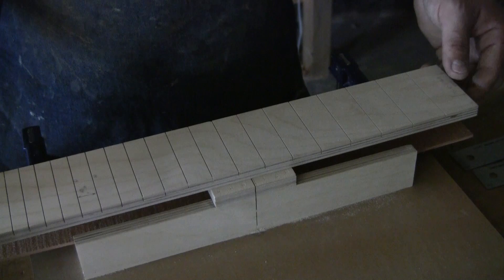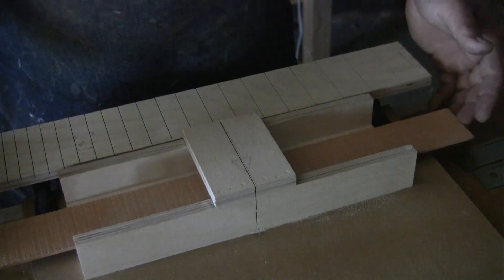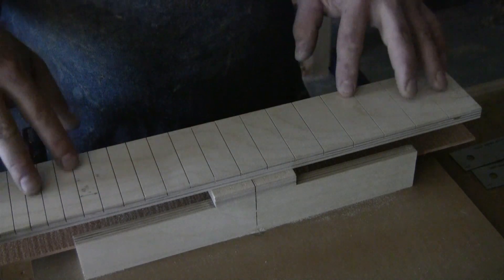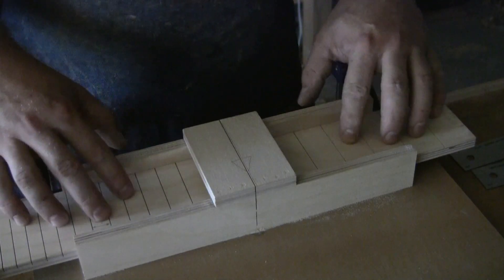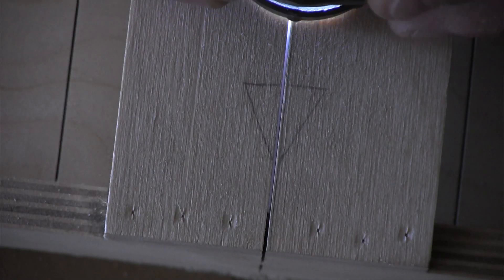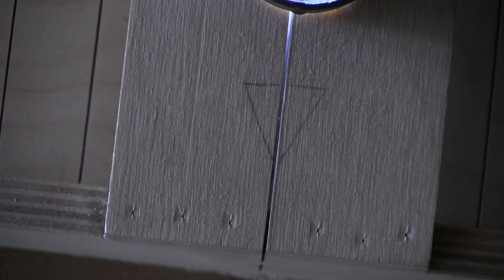To make the templates that go into the jig out of plywood, I take two shims and sit them against the nails in the middle, which register into the jig so that the piece of wood can slide freely from side to side. I take my plywood and mark out — either with a knife or a pencil — very accurately the scale length on the plywood. I slide it into the jig. You'll notice the width of this piece is pretty close to the width of the jig so there's not a lot of movement. Once it's in, imagine this is a blank piece of wood with pencil lines on it. I take a nice bright light and sit it on the center so I can see down into the kerf of the cut in my jig.